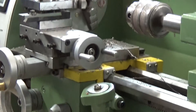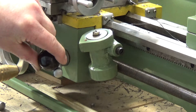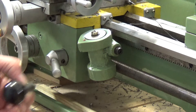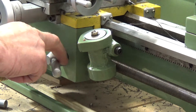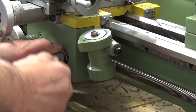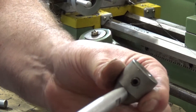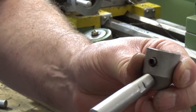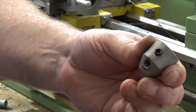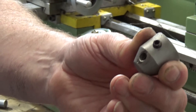Ready to replace that one like so. The handle's done, but we've still got to take this off. Now there's a grub screw on here which I've loosened off, and I've actually had this off already, but I will warn you it is pretty tight. There we go — so that's the actual item. I did actually have to persuade it gently with a copper hammer to get that off initially. And now what I'm going to do is basically take the handle off — put this in a vice and just find a nice flat on there so that the new handle will have something to bed down against properly. I'll do that off camera.